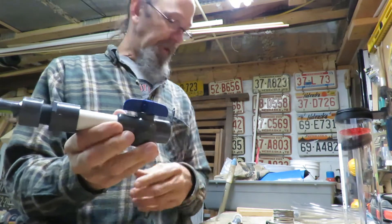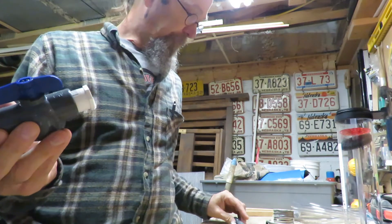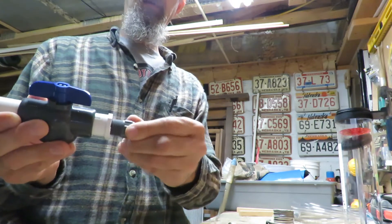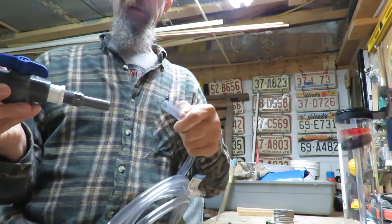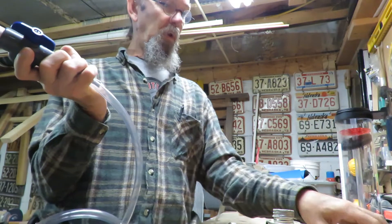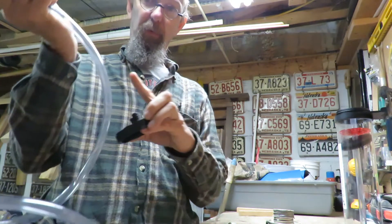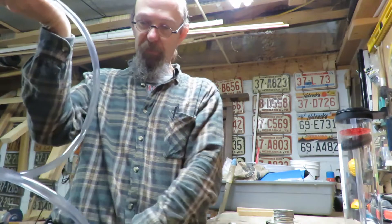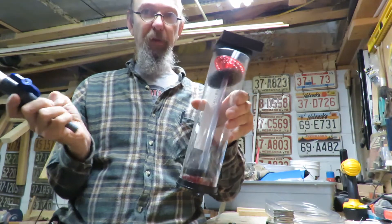I think I'll cut this off a little shorter. That gives me my ball valve. From there I glue this fitting in here — this one's threaded. So once I get that threaded, this is a reducer. I thread tape this into there. I then use this smaller hose and go from here — I'm going to have to heat this up in a cup of water — and then put this into here, and this will go from here into the top of the reactor on that fitting there. That'll be the intake. The outtake will come out of here with more of this hose. This has to go from under the tank all the way up top and return up top.